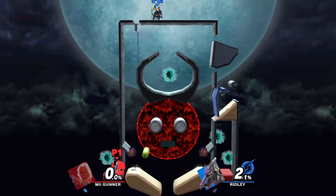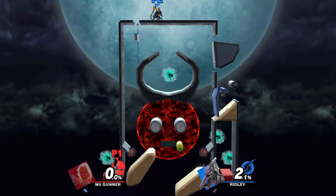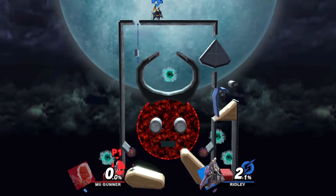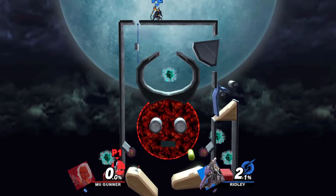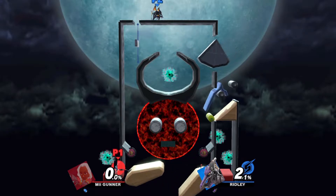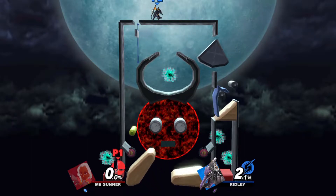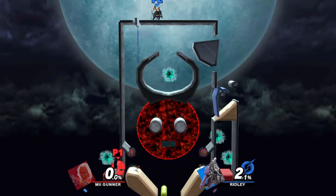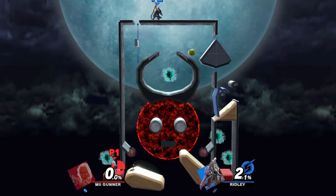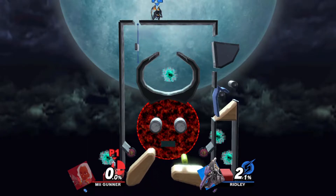The doorway also works with gravity and physics, and I actually had to go through many different door designs to get it to work just right. Now normally in a pinball machine, there is a device known as the spring launcher, which of course launches the ball into the playing field. For a while, I did actually try to emulate this device using a vertically moving platform, but I got rid of it because it produced kind of inconsistent results — oftentimes it would just take too long for the ball to actually get into the playing field.